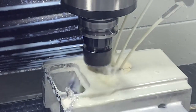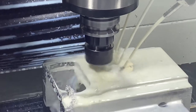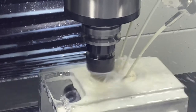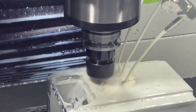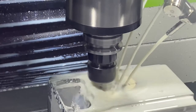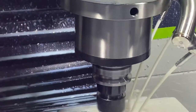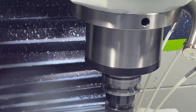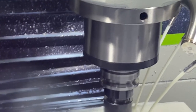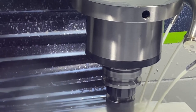It's a recess. And so far my coolant on, coolant off seems to work — just adding a bunch of M08s and M09s. But I'm going to go edit the post processor so it adds these automatically at the beginning and the end. I'm really tempted to pause it and blow some air in there and see what we got, but I know it's doing its thing.